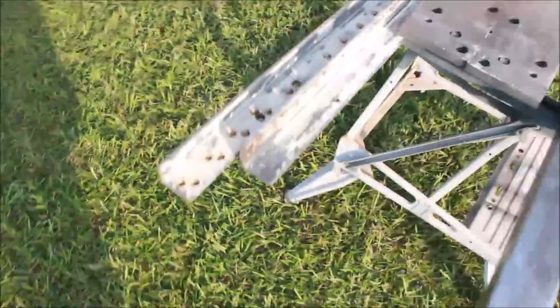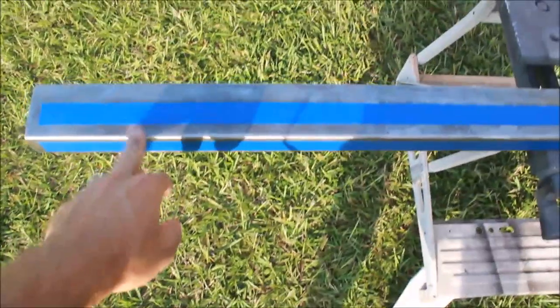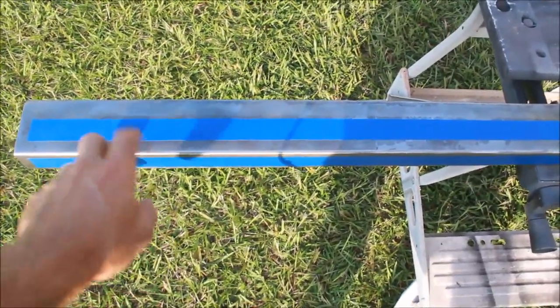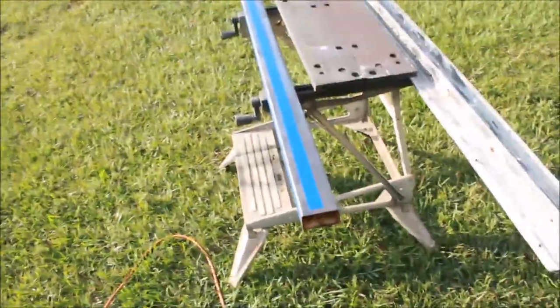All the paint is stripped off, all the rust removed, and all the loose paint cleaned off these parts. Now we're ready to prime. The key thing on this tubing is to tape off the areas where the fence will ride, so you get that nice look that the fences have — nice clean lines. Got that all taped off and we're good to go.